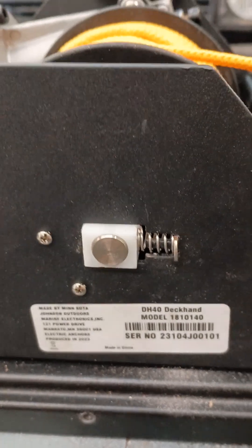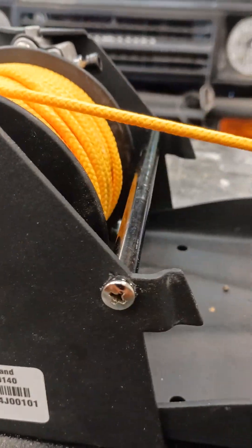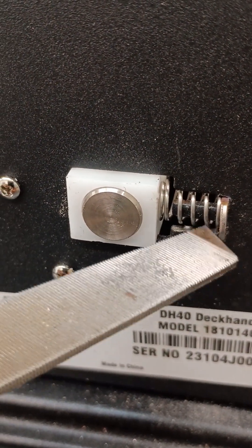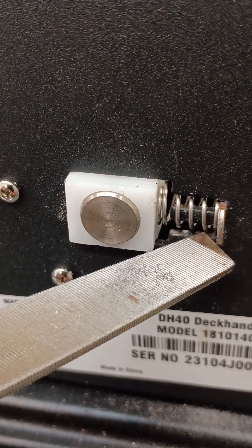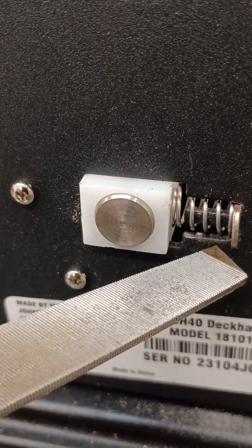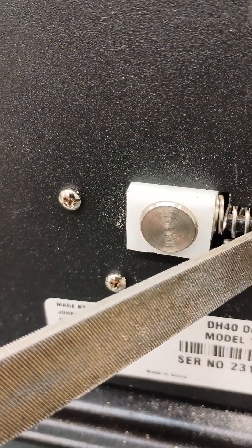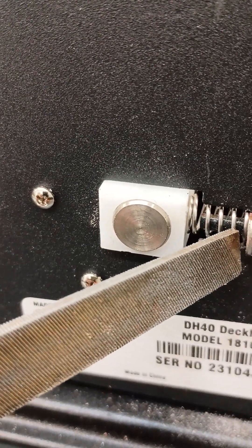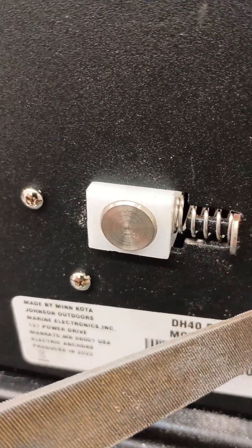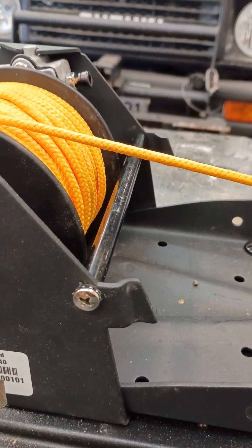The amount of effort to open and close it is based upon a spring and its tension. What I did was adjust the tension by filing the two slots — you can see the spring rides on two slots. Filing reduces the tension by about 30%.